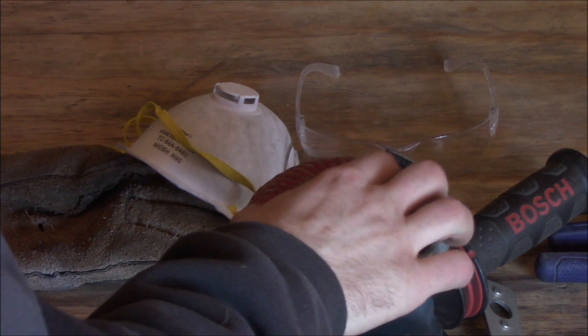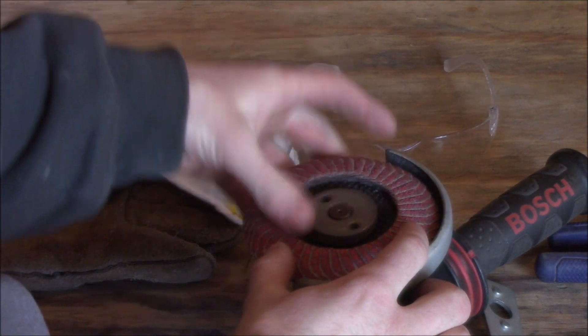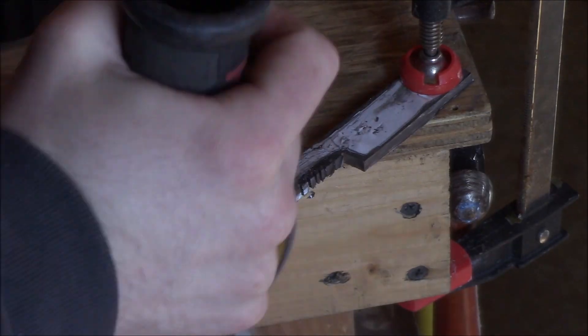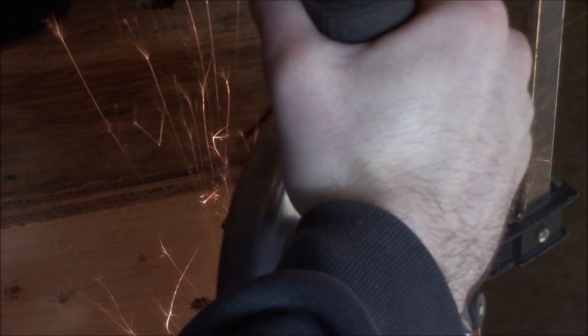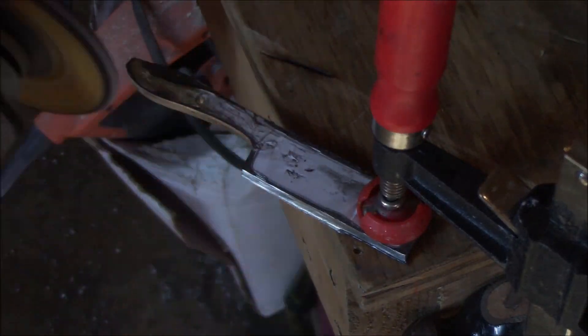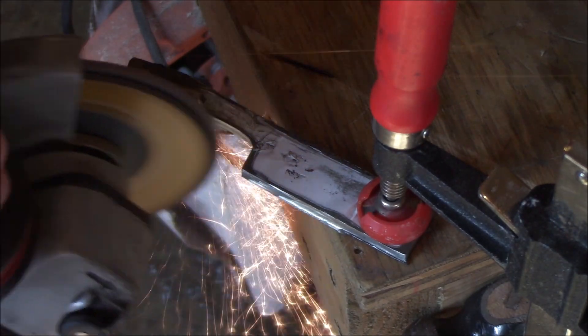It's cold in my workshop. Once I've got the blade rough shaped using the cutting wheel, I run over to the 40-grit sanding wheel on my angle grinder. This is my favorite way to get fine lines. Another little side note — I was always taught that you can tell the relative carbon content of the steel by looking at the sparks. If they flower at the end like you're seeing here, that means the steel will likely be able to harden.